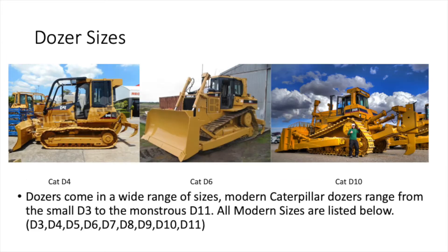The second piece of equipment would be dozers. Dozers come in many different sizes, as you can see here, all the way from a low D4 to the D6 you see in front of you in the middle, upwards to a D10 or D11, which aren't as common. They have different applications depending on existing site conditions and the work being performed, but are very common in rough grading operations — particularly for cutting material, assisting by pushing scrapers through a cut, or ripping up material.